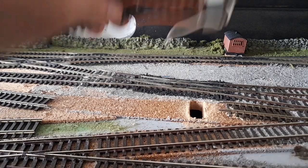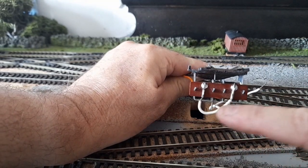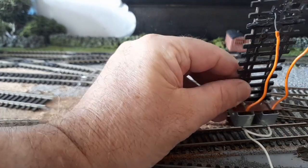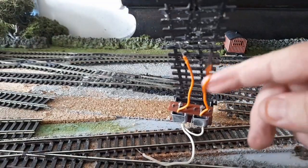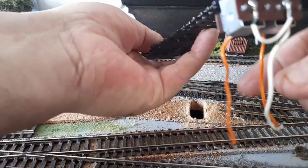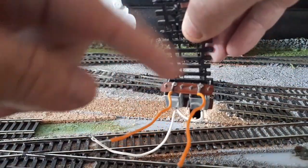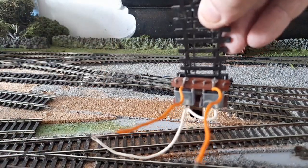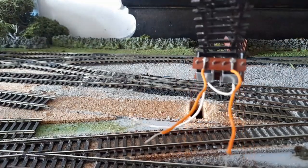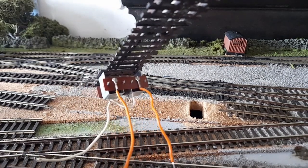Now with this motor — there's the back of the motor, you can see the U-shape which is your continuity between the two poles — I'm going to replace that with new wire because this is far too thick. On the opposite side we have two more wires which will go to the switch. The wire coming off the loop will be removed, and then I'll be able to show you the new wiring nice and neat and what the motor looks like once I've cut down all these bits and pieces.